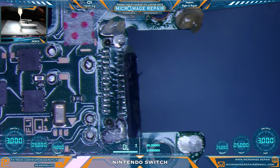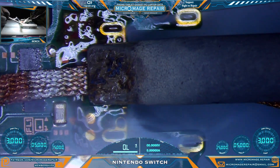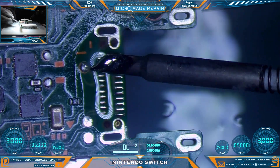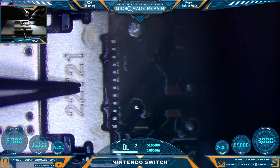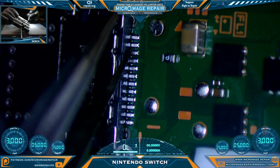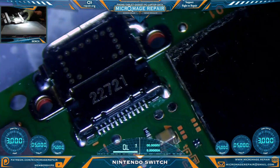In order to put on a new port we must clean off the high temperature and low melt solder. Hold it down and wait for everything to dry. Sometimes you can neglect the outer pins when concentrating on getting that inner row down. Everything looks excellent — look at those fillets. Factory fresh.